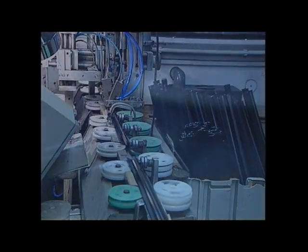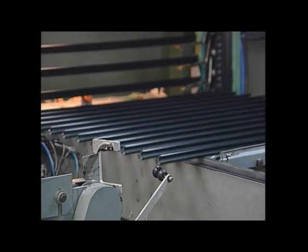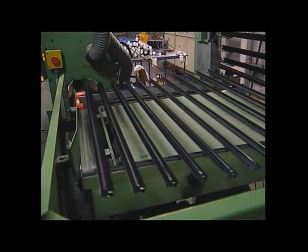The continuous flocking is carried out in two lines, or depending on the plant in one line, whereby even complicated forms and back cuttings are flocked — sometimes partly electrostatically and sometimes with a combined electrostatic-pneumatic system. After the flocking and the pre-clean, the hinged profile cut lengths run through a dryer with a very large capacity, so that even with a high production rate a sufficiently long drying time is guaranteed.